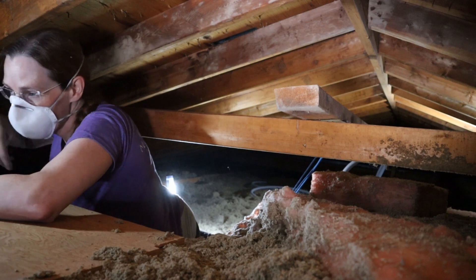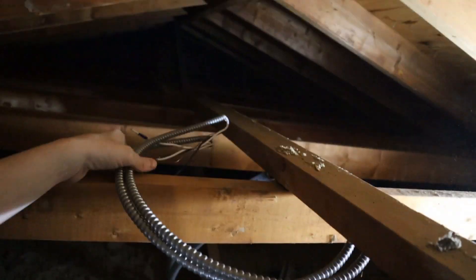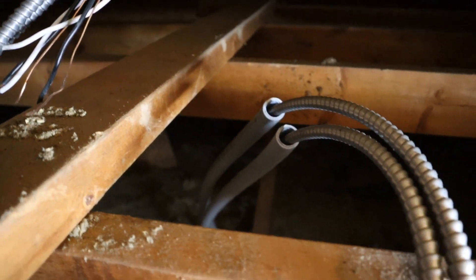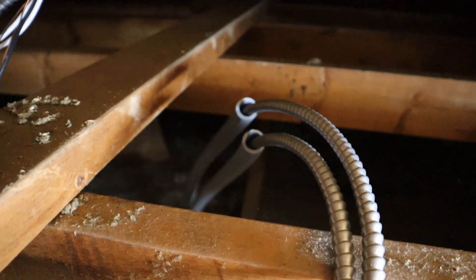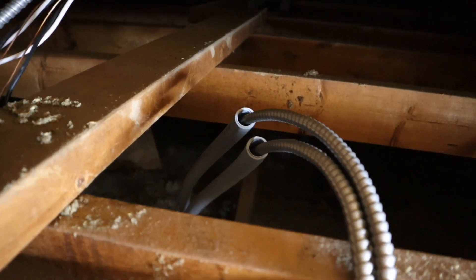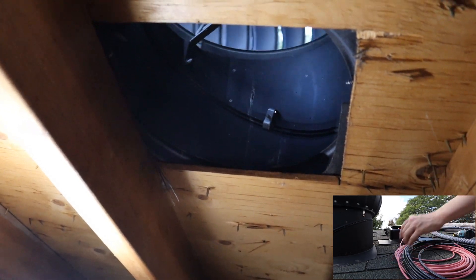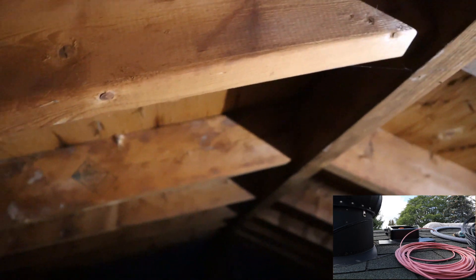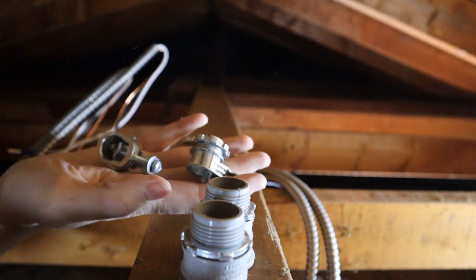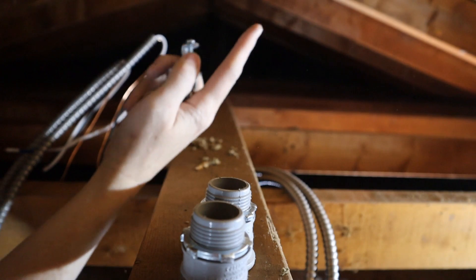This is the best lighting that's ever been up here. So this is the BX — you can see that's the conduit it's run up in from the basement. Some people were concerned about the fact that I was using plastic conduit. The wire is armored — it's metal. The plastic conduit is only there to make it easy to fish wires up and down in the future if I ever want to change these out. If you remember the vent that was spinning when I was up on the roof last time, that's it right there. There's the solar deck and the panels are right there.